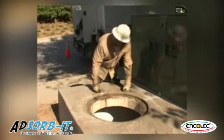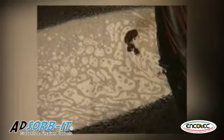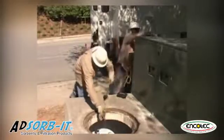Hey, Louis, the hole is filled with water. The first step in dewatering is to analyze the vault water. A visual inspection will tell you if there is oil sheen or discolored water inside the vault. The bailer is prepared and dropped into the water. Louis, why don't you get the filter sock bucket? Okay. When the water is collected, the bailer is removed for examination.